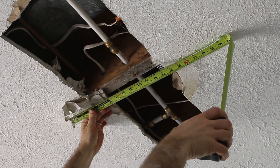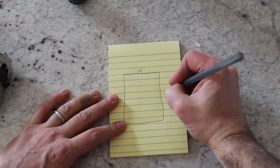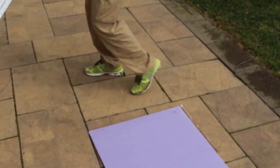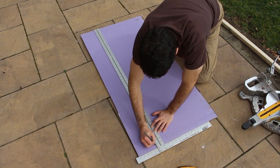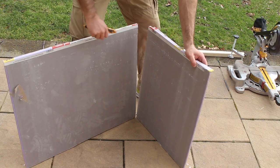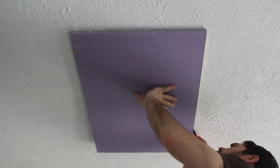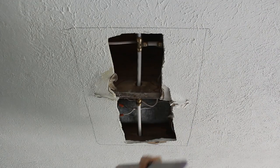Measure the widest part of the opening in your drywall and also the length of the piece that you're going to need. I like to write this down because I always forget the dimensions. Fortunately I had an extra piece of purple board from another project. I just used my drywall square to mark out the dimensions and cut it to size. You can use a utility knife to do this — very easy, only going to take you a few minutes. Then place that piece of drywall on your ceiling and trace the outline of it using a marker, which gives you a clear guide for cutting out that drywall.